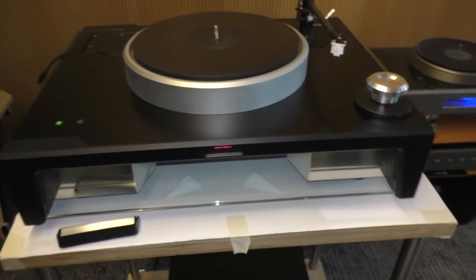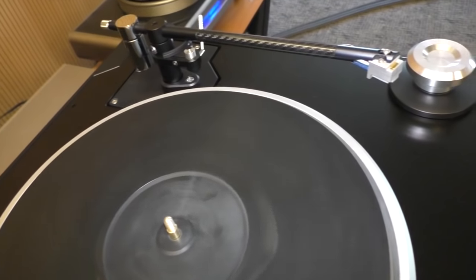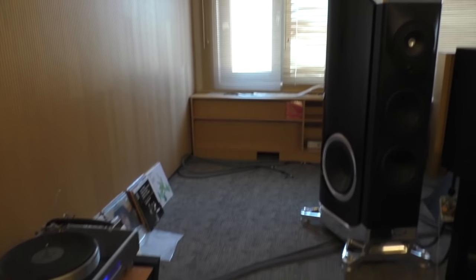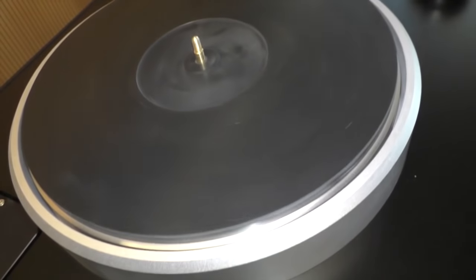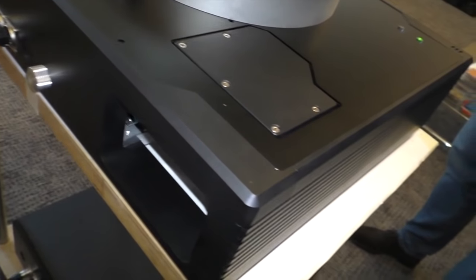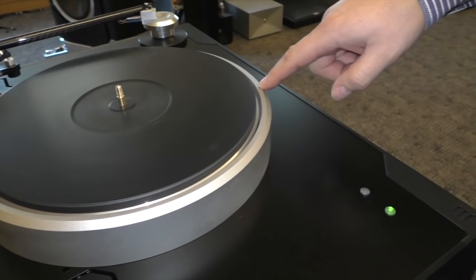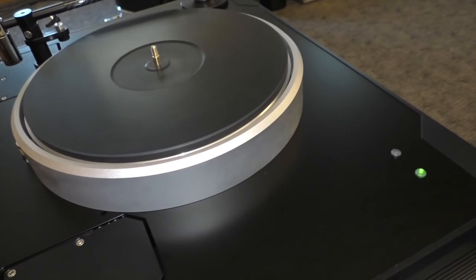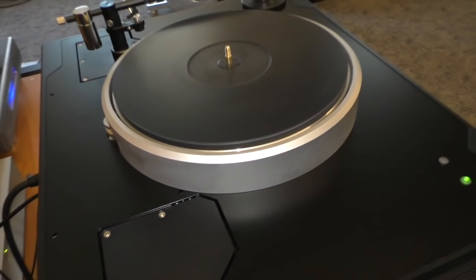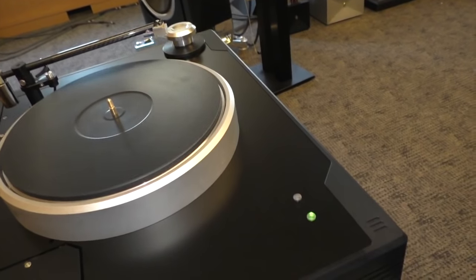And then the controller and table are put together. We put in the serial number, and then we do the speed check. For the speed check, we use two different tools. One that you're familiar with. Yes. And also the laser tachograph from Sutherland. Then the speed is programmed depending on the ratio between the pulley and the platter and the thickness and batch of the belts. Usually from when we boot it up, it's within 0.5%, and we just need to adjust it specifically.